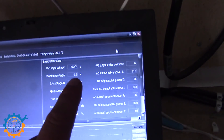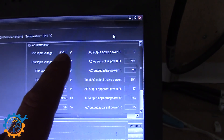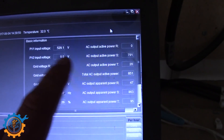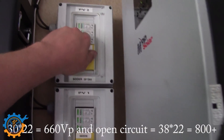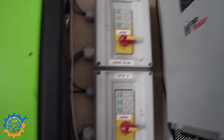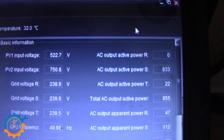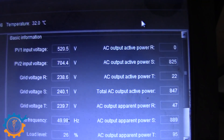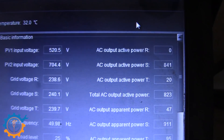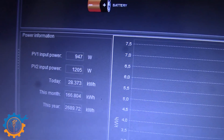If we compare the voltage here, we were around 500V before, so we should be somewhere around 600V now. Let's hook this one up — and we go down and see that the voltage came online at 750V, which should be dropping as soon as the MPPT goes into charge mode. And it already began. As you can see, PV1 is generating as well.